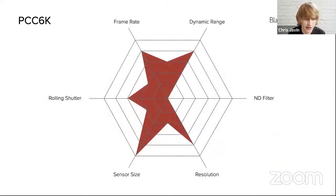You can already see the change in the diagram of what it highlights, but obviously the key change is that higher native 6K resolution. The benefits include the ability to downsample to produce cleaner and sharper images in a 4K or 2K deliverable, reframing, rescaling, stabilization in post-production, creating multiple shots in one frame, and ultimately to ensure your work is future-proof. Pair the 6K with the larger Super 35mm sensor and you get incredible resolution in a compact form factor with access to a wide variety of cinematic EF lenses natively on the mount.